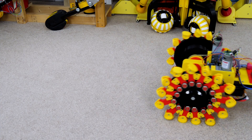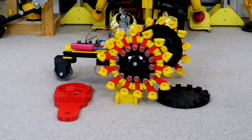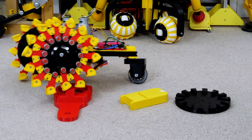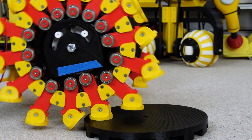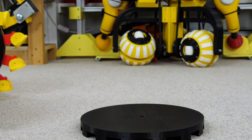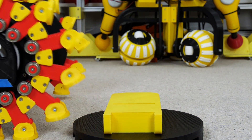We need to test a variety of objects to see how practical it is at actually climbing over things. I'm using some discarded 3D prints from various projects and it looks like it actually works pretty well. There are a few issues with the flat feet slipping sometimes but it's a pretty good test to see if the mechanism works. I put a stripe of blue tape on the bottom of the guide so you should be able to see it leaning backwards and forwards and complying with the object as it runs up and down steps. It looks like it works here but let's try some steeper steps - we can see that stripe going all the way up and all the way down on the other side again, which seems to be working pretty well.